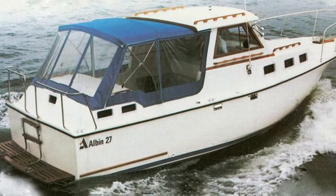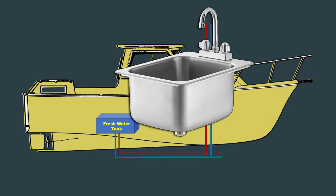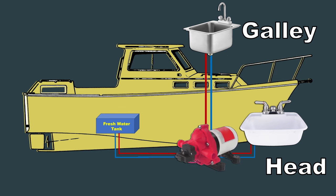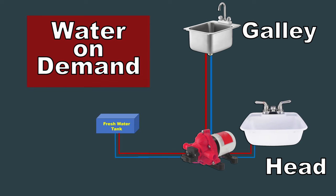The vehicle or vessel carries its own water supply. Wastewater is either collected on board or pumped overboard. Freshwater is supplied from the freshwater tank to the galley and also to the bathroom on the boat. Typically this is done using some type of electrical pump, which maintains constant pressure in the water lines so water is on demand when you go to the sink or the shower.